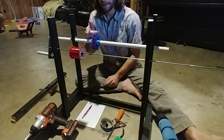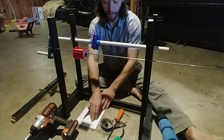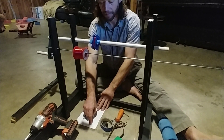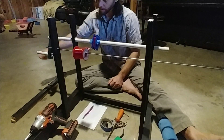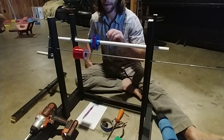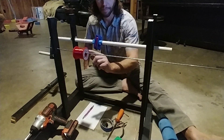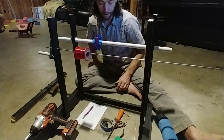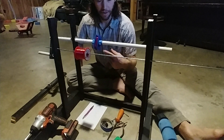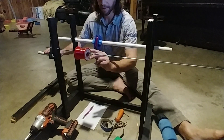As I turn this, it's important to keep track of my count, so I have a sheet of paper. I'm going to put a tick mark for every 50 turns. I've found that it's better to keep some tension on the wire as I'm doing it, just so the wire wraps nicely. So I'm going to do another 50 turns here and kind of show you how it happens.